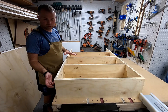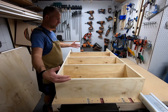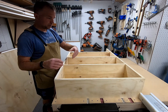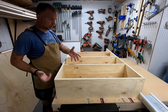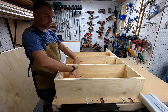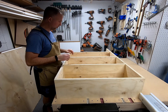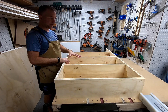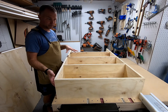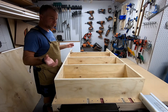Most of this I'm going to nail and glue together, but I am going to do some pocket screwing to screw down to the bottoms and tops. On the back pieces — which I haven't cut yet — I'm going to pocket screw them from behind to lock everything together. I'll glue all the shelves in, and the back pieces will sit inset inside, making it sturdier. Then I'll screw it all together and measure and cut those backing pieces.